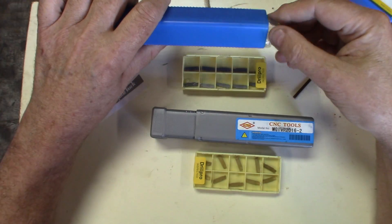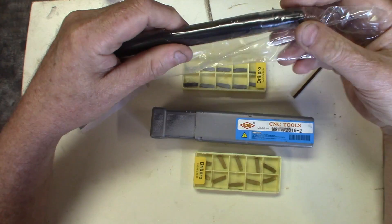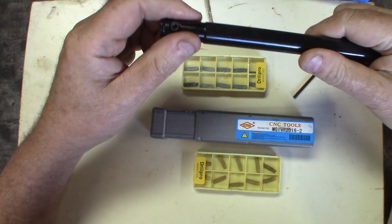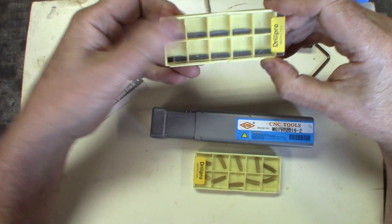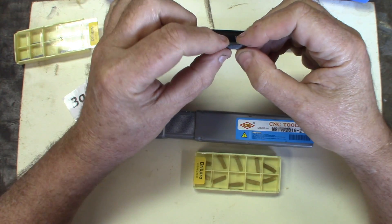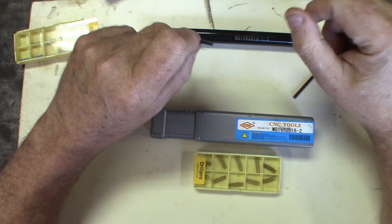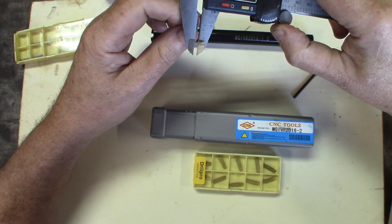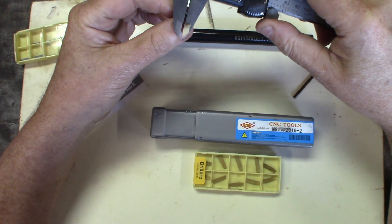I'll test only one since it could be repetitive — I'll be testing the 1.5mm. They came with the key, wrapped in a bag with plastic tubing. They're a little greasy and ready to get the insert in. If you're a machinist, you don't worry about a bit of grease — that's part of the game. The inserts are very small; 1.5mm wide corresponds to about 0.060 inches imperial. Measuring it, we read 0.059 — pretty close to 0.060.